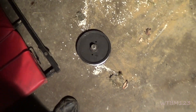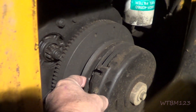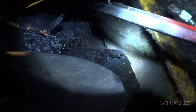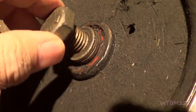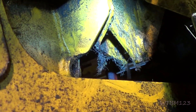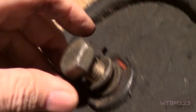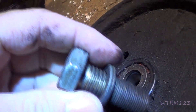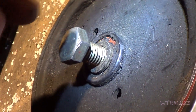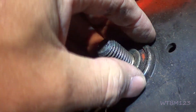Here's a pulley on the back that they've taken off. You've got this electric clutch here, so your belt's going to wrap around the clutch. There's a pulley here that's at an angle, and then on up under here, this pulley bolts on. Here's the bracket that the other pulley attaches to — the pulley's on the other side and the bolt just comes through. They said when they tightened that pulley down it wouldn't spin. We think we know the problem: there are two washers, and one washer goes on the back as a spacer. That way it tightens down against the washer and not on the pulley.